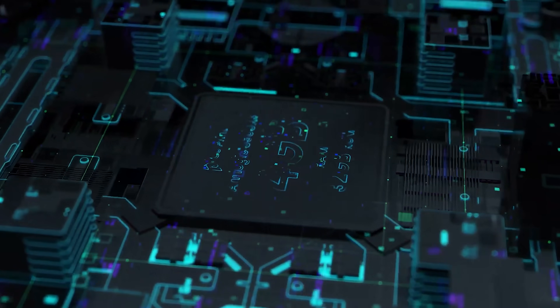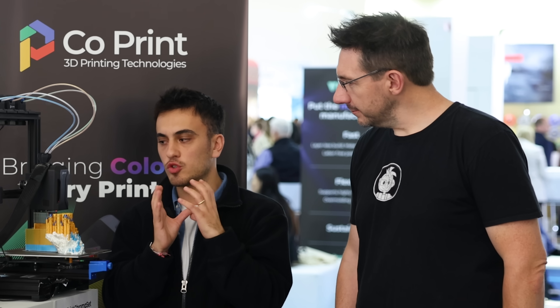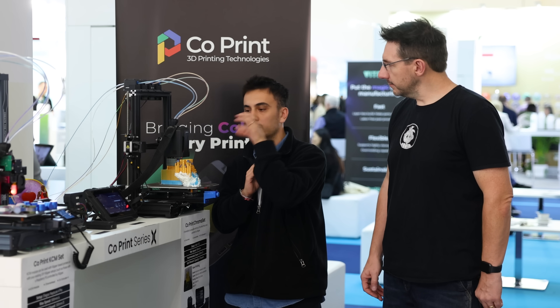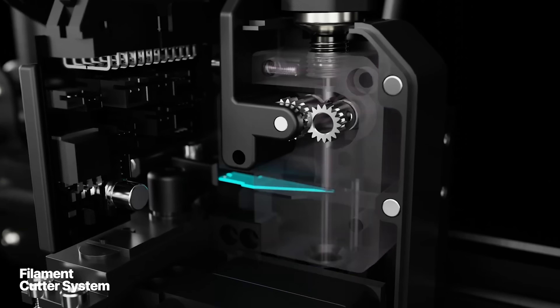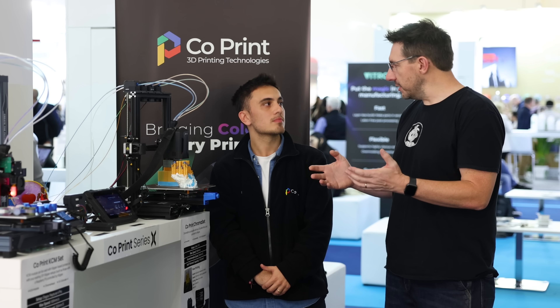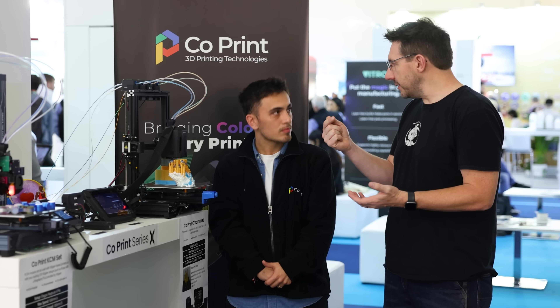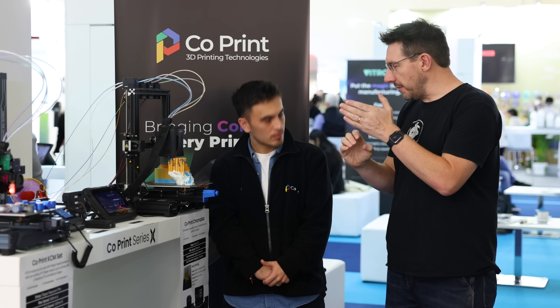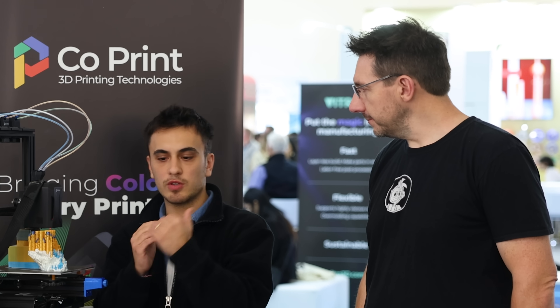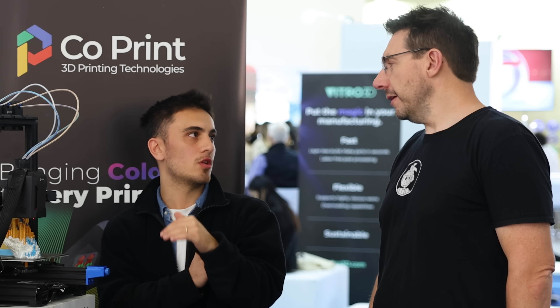Even though the ChromaPad has a strong processor — even stronger than a Raspberry Pi — we had to make sure everything goes smooth at the head. So we brought the ChromaHat into the game as well. Inside the ChromaHat there's a servo motor controlling a filament cutter. When it's changing color, the filament is cut. That's one of the advancements in filament changes: instead of tip-shaping and retracting, you're cutting just above the cold zone and feeding new material in.